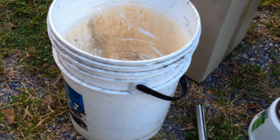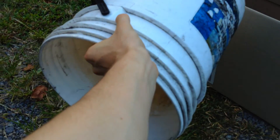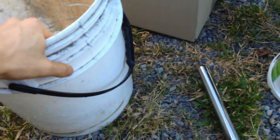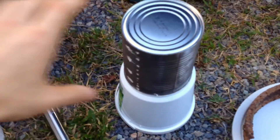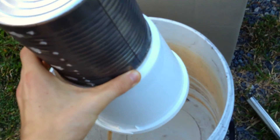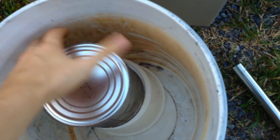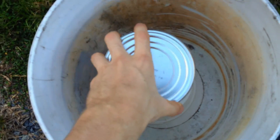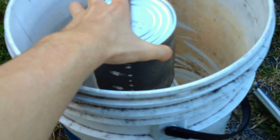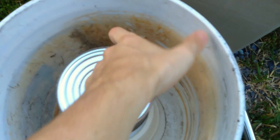This bucket is going to comprise my outer shell, so I'll probably have this lying down. There will be an opening at the front for you to put things in, to get metal up to a few thousand degrees. These two here will combine and use as my inner — they'll kind of fit in and be a little way off the bottom, and I'll fill around there with concrete, so I'll get a nice insulating barrier of concrete and sand.